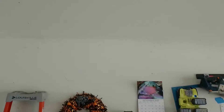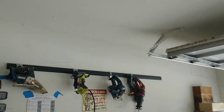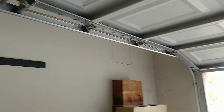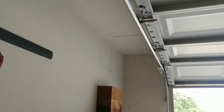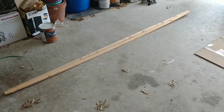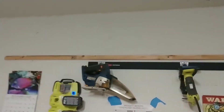I've located the ceiling joists and studs in the wall and marked them. The ceiling joists are about 20 inches apart, so I'm going to end right in line with the attic hatch — there'll be about a foot and a half of the bench without shelving over it, but that's not a big deal. The lower shelving will end here, then we go up to match the garage door height. We're only coming out 20 inches because the scrap wood I have is only 20 inches deep. Now I'm going to tack these up using two-inch sheetrock screws at the heights we need, then lay out the actual supports.